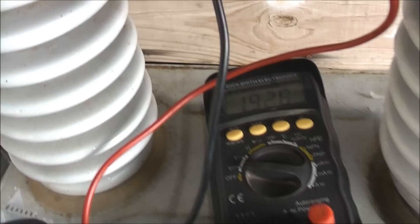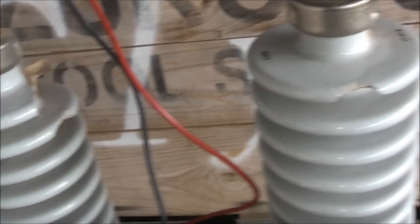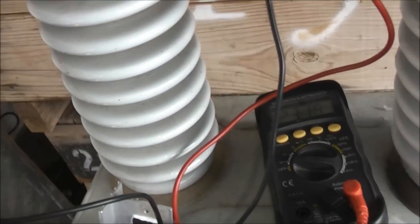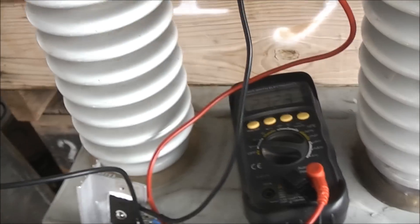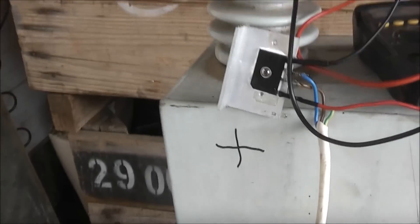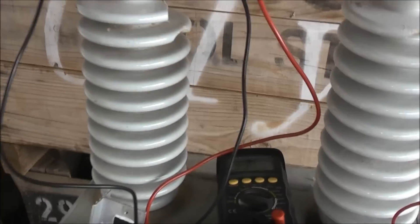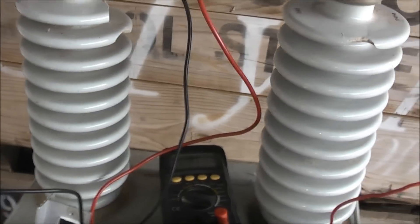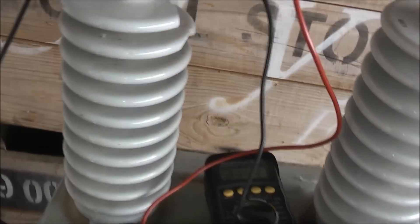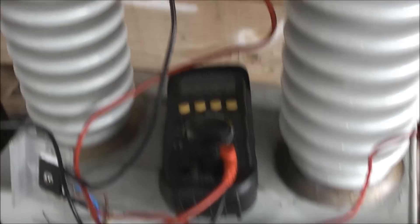All I have now is a high-voltage bridge rectifier for my MOT. So I've got to go on eBay and buy a high-voltage bridge rectifier. Hopefully we can get this thing reformed. It just takes a million years to charge. You'll notice this electrode is slightly bigger — this standoff — so that's the positive, this is the negative. I should have done that before, because I just relied on the multimeter to tell me which one was which, and the multimeter told me this was positive when that was wrong. So this capacitor is depolarized, then, if that's the case.